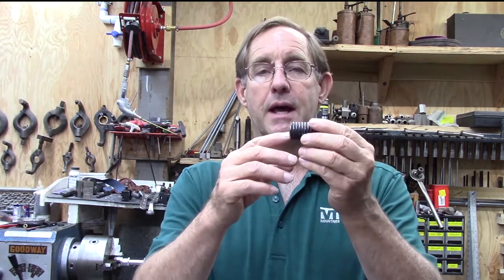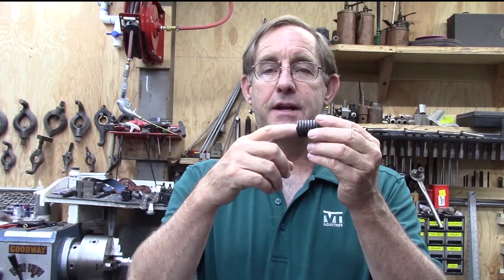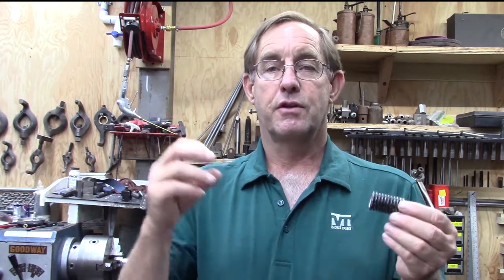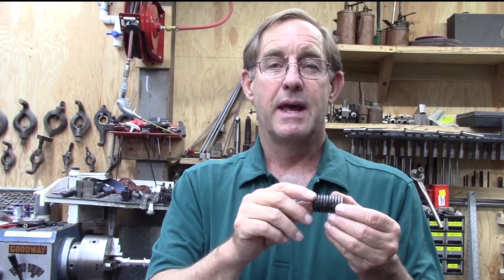I've already made some of these little parts that need to go in here because this size, this inside dimension, is not the same as the inside dimension of your regular flex conduit. So thus those parts will not work, and we can't modify them. So anyway, what we're making here are some little parts for that stainless steel conduit. I'll go grab you a part, bring it back, and show you what the finished product's going to look like, because I've made a sample part that I've tested and it works perfectly.